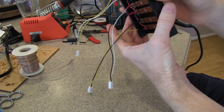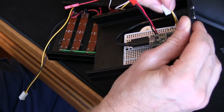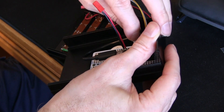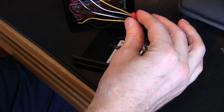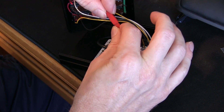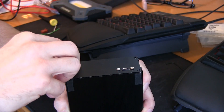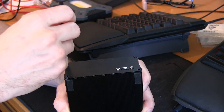Here's the back side — I'm sliding in heat shrink tubing to cover where I solder the analog leads to the slide potentiometer posts, just to prevent inadvertent shorting of the power or ground lines. Here are my six analog leads and the two power leads — analog ground and 3.3V — all ready for assembly. The USB header is optional; I got it from SparkFun for $2.50. I like being able to detach the USB cable so if it wears out I can replace just the cable. I could have run the USB cable directly into the Arduino's port. There's a lot more space inside than I needed, so you could use a smaller box — and if you can find something plastic, that would make this build a lot easier.